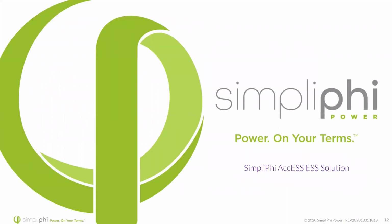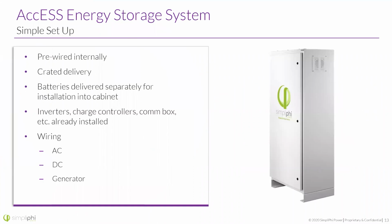Okay, so if you're installing PV already, maybe you want to get into the battery world, we offer the Access solution we just talked about. This is an energy storage solution system where we really are trying to make things a little easier on everybody. Pre-wired internally, arriving on site like that, the batteries are the only thing that you need to connect internally into the unit. Other than that, you're just running AC wires for the most part, or DC if you're going DC coupled.